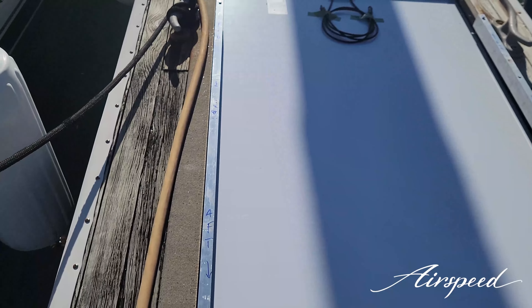The only way to do that is to drill the holes in the arch tubes first, up top — like so here and here and on the other side. You have to do that while the truss, the rectangular tubing, is not connected to the solar panel, because you need to drill through the top and the bottom and then through the frame of the solar panel itself. So I've elected to mount the solar panel to the trusses and then mount the entire assembly to the arch. There will be four bolts securing the solar panel to the trusses, and an additional four bolts securing the truss-and-solar-panel assembly to the arch — per panel. So we're looking at a total of 16 bolts, 16 holes, and everything needs to line up perfectly.